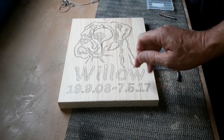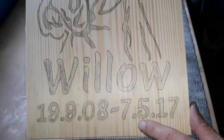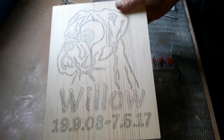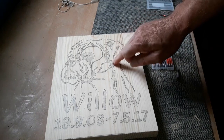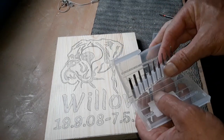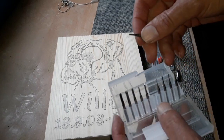We'll go around all the outlines first, and that's basically just going to separate the lettering from the backing. If you come in with a bigger piece you're not going to have bits chipping away - these little dots here could soon fly off. So to play safe we'll go all the way around them; we've basically made a barrier so as we get near with the other piece it's not going to interfere. Then for the clear-out of the bigger dark sections, we're going to try these mill-end carbide CNC bits - I ordered these by mistake but I'm glad I got them.